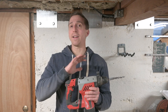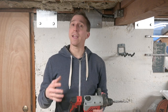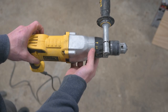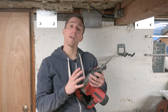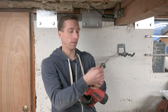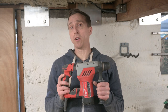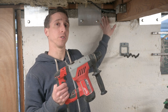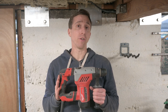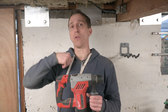This is the rotary hammer and this will make your life so much easier when drilling into the concrete of your foundation. I first started off using a hammer drill, not knowing there is a very big difference, and it took me ages to drill every hole for these foundation plates. With one of these I could drill a hole in about 30 seconds. This rotary hammer comes with the SDS plus style bits and chuck, which is quite different than a regular drill bit. This rotary hammer did cost $270 plus tax, but I think it's well worth it because contractors told me they charged $200 per plate. Home Depot rents these for $40 a day, so if you already had all your plates screwed into the mud sills you could easily rent one and go through all your holes in a single day.